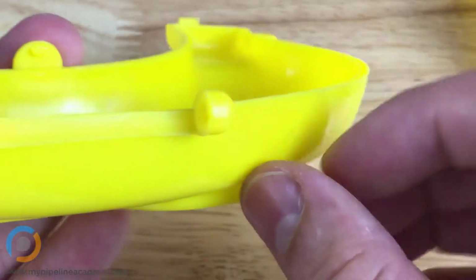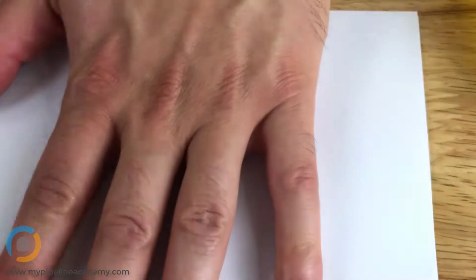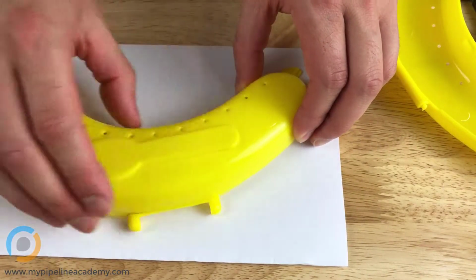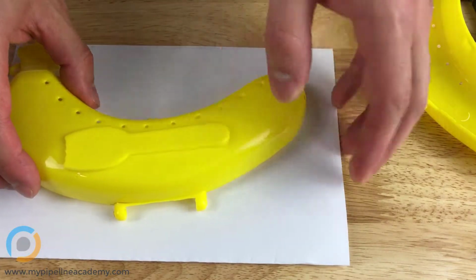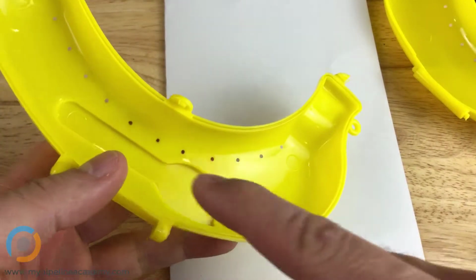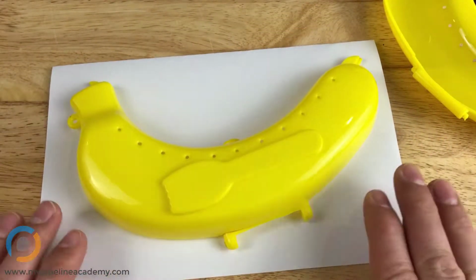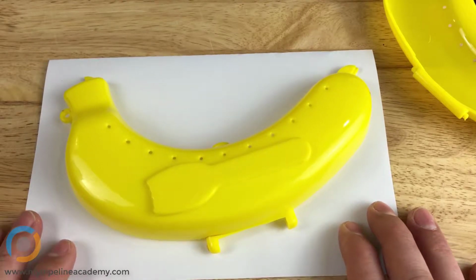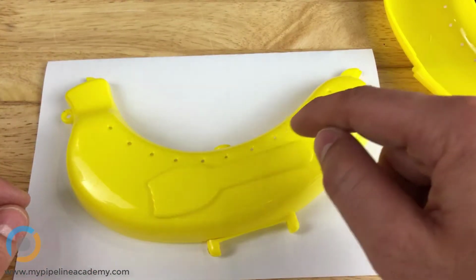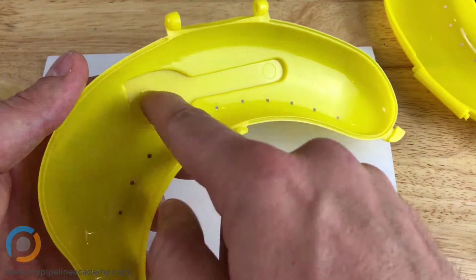So the two molds that made this part, it almost looked like this from the way you're explaining it. So it looked like a mold on the bottom and then a mold at the top. The top part of the tool was like this, and the other one was almost flat. That's right. Except for these three things sticking out, basically. That's exactly right. Yep, except for these three areas that protruded beyond that plane. Yeah, but the bottom half of the tool, or the core, so this paper would represent more or less the core, that was mostly a flat tool around the perimeter. Of course, there was a mountain inside that created this cored out geometry.